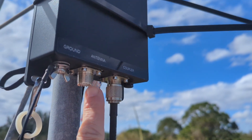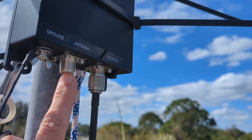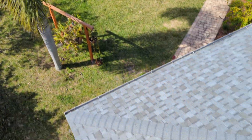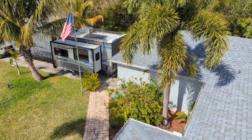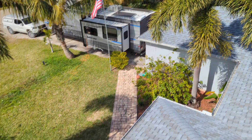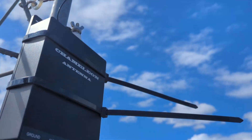You could also use this with a coax-fed antenna. If you put a vertical here — a five-band vertical — and you want to use it for something other than what it's rated for in resonance, you can attach this right at the feed point of your antenna and tune. Tuning at the feed point eliminates all the loss and high standing wave on the coax all the way out to that RV. Because putting a tuner at the radio or inside the radio — that's matching, giving the radio a perfect feed point despite the coax losses from the non-resonant antenna. Whereas using this at the feed point is going to totally make that wire work.